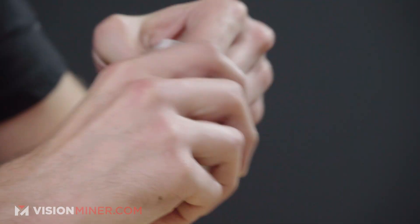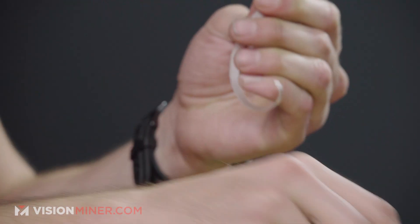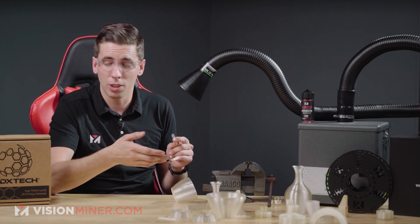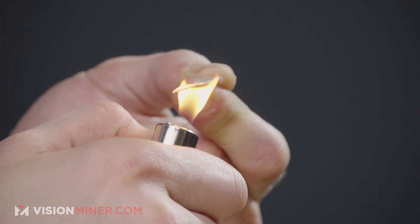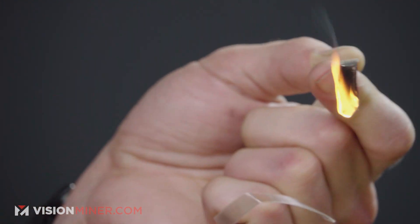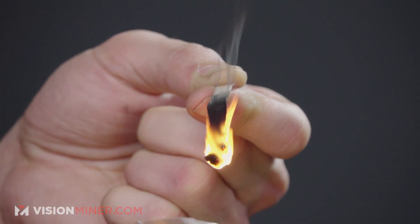Let's break up a chunk and see how this burns — we're going to watch if it lights on fire, if it drips, how much it smokes, and how long it smokes. After 10 seconds in a flame, it's on fire and it's still burning. This is not a UL 94 V0 FST rating — as you can see, it's not extinguishing itself. Unlike a lot of our other high temp materials with the UL 94 V0 FST rating, it is not self-extinguishing and it does put off a lot more fumes.